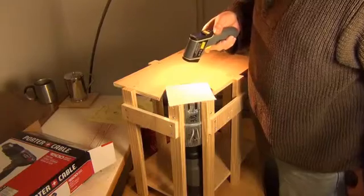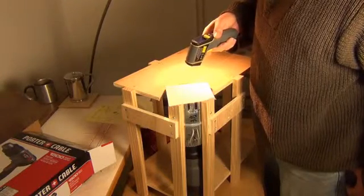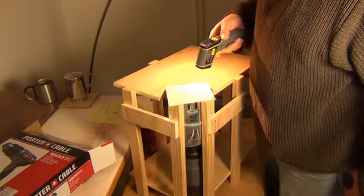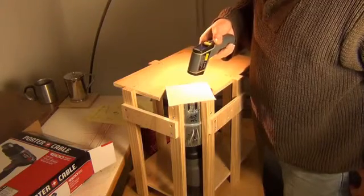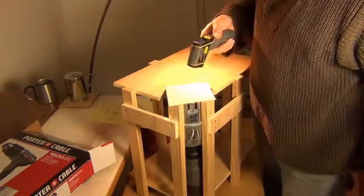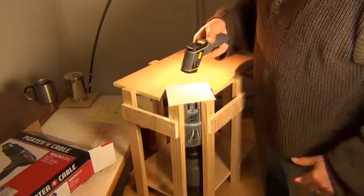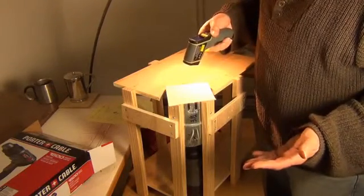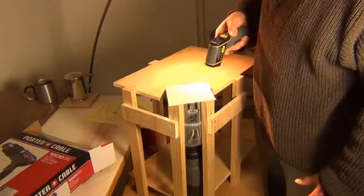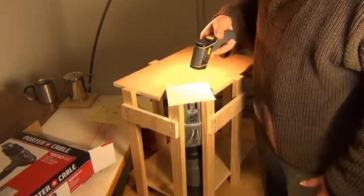Basically what you're doing is getting rid of the hot spots. Now we're 126, 120, 140, 150, 160. There you go. There we go. Nice combination. Okay, so when you get a nice even heat, it'll probably vary between 20 to 30 degrees across here, but still there's no drastic hot spots, and everything is up to at least 140 degrees Celsius.